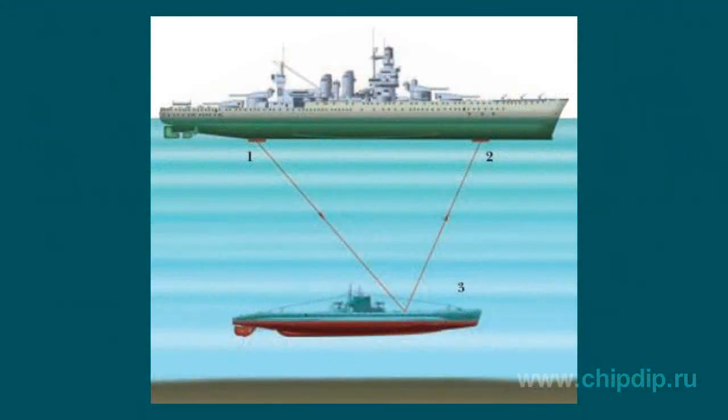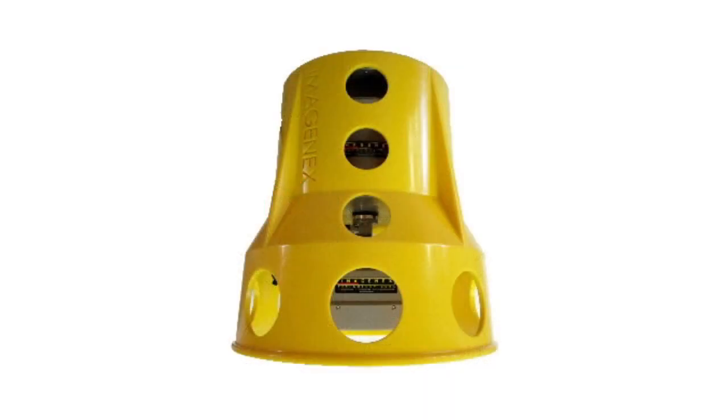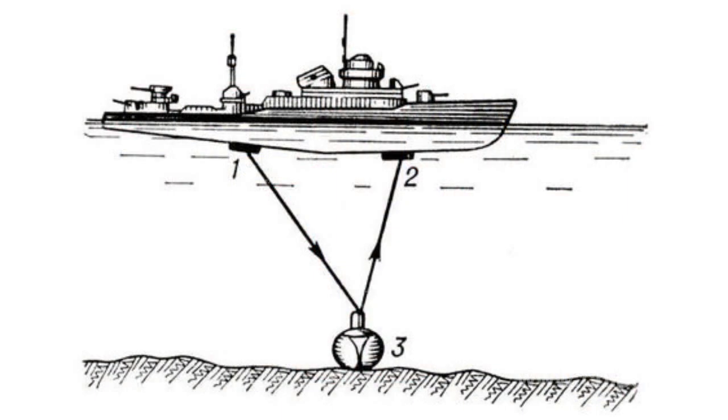There is a special echoranging equipment called SONAR, which is an abbreviation of Sound Navigation and Ranging. SONAR comprises a number of main units of a transceiver and transmits acoustic pulses in a selected direction and receives the signal reflected by an object or the signal generated by an object. In the latter case, a SONAR is called passive. Consequently, SONARs are called active if objects are detected by reflective pulses, or so-called ping sets.